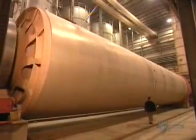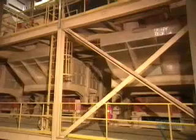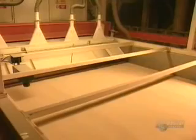Pieces too big for particleboard are fed through the mill again. Sawdust becomes fuel for the dryers. Larger particles go into the rougher core layer of the particleboard, smaller pieces into the smoother surface layer. Meanwhile, the factory's glue department gets to work mixing resin, water, wax, and chemical hardeners.